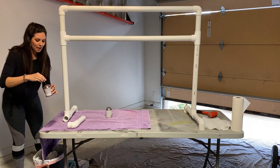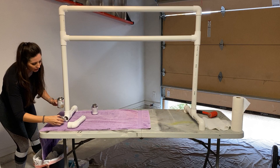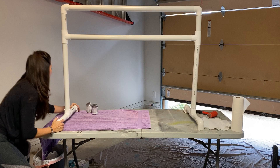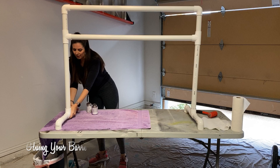We're going to start with a really light coat of the purple primer — this stuff is really runny, a little bit messy, so a really light coat. And then a quick coat of the clear cement. I'm going to press this in good and tight. Working on a nice sturdy flat surface is ideal — maybe do this on the floor. I keep taking it down to the cement where I can double check my work.